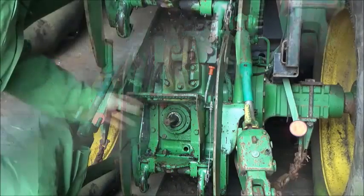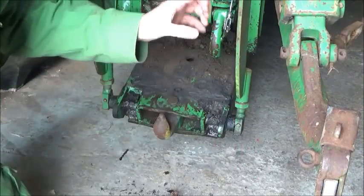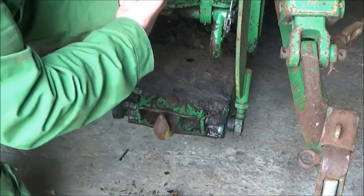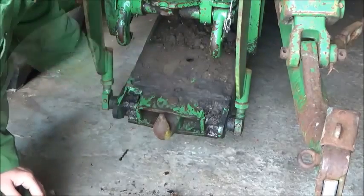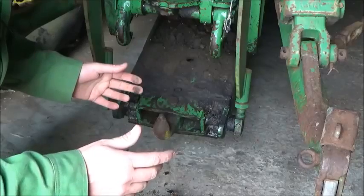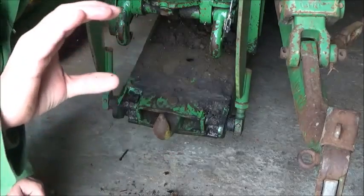What you need to look out for is wear in the bottom here, because where the ring on the trailer is and the hook — as you turn the corner with your trailer there is an action there and it's going to wear because there's friction.